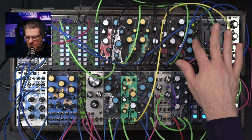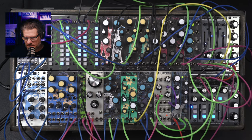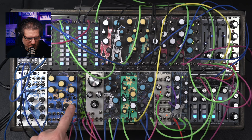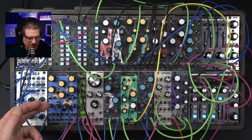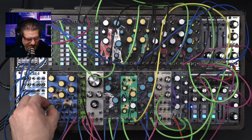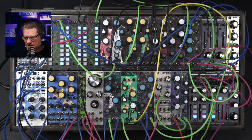The first version of this module, the LEDs were upside down. In this module, I put the CV pots oriented underneath. They're oriented incorrectly for the knobs I want to use. So, little things like that. But the hardest thing we ever did was probably the Voltage Lab. That thing was a nightmare to tame the signal bleed because it was so dense, which is another reason why the Voltage Lab 2 is 90 HP, because we wanted room for those signals to live without bleeding into each other.